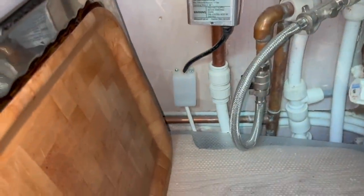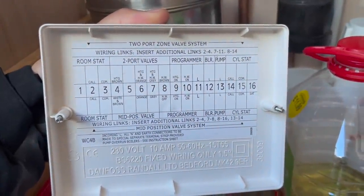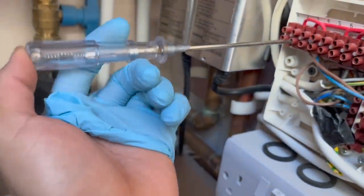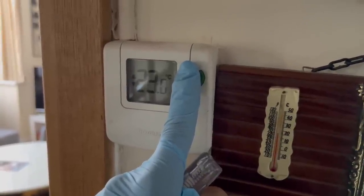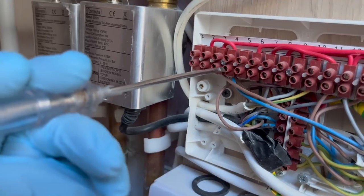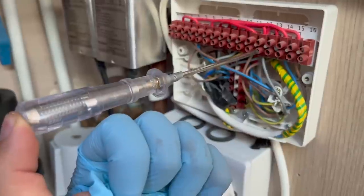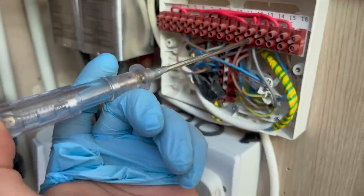For this job we've got no heating. What we're going to do is a bit of fault finding to see what the issue is. Looking at this little diagram, on number four you can see this is where we should be getting power when there's a demand for heating. I'm going to test if there's any power right now on number four - no, there's not, and this is good because the thermostat is off. So now I'm going to go over to the thermostat, turn it on and see if I then get power there. Now we are getting power on number four, which is perfect. We've also got power on the permanent live, the gray. In theory we should be getting power on the orange now, but we're not - which indicates we've got some type of issue with the zone valve.